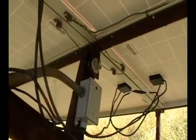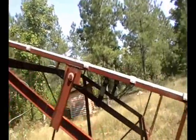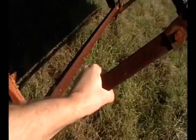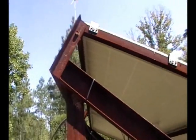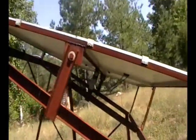You see this hinge here — basically it's just a bolt, with one in the middle and one on the end. This allows me to change the angle. Right now it's set up for summer, and what I'll do is drop this edge down. I'll pull that out on all three spots, put them up here, and lengthen that. Basically that's going to make my solar panels more perpendicular to the sun when it becomes winter time, when the sun is lower in the sky.